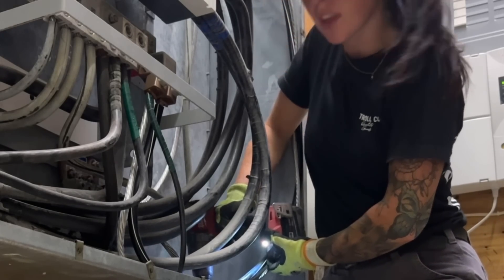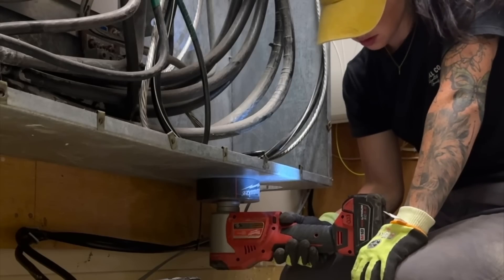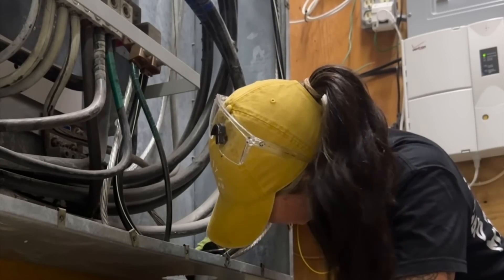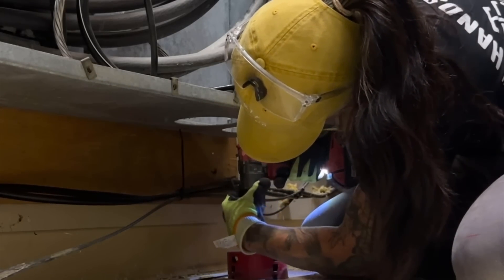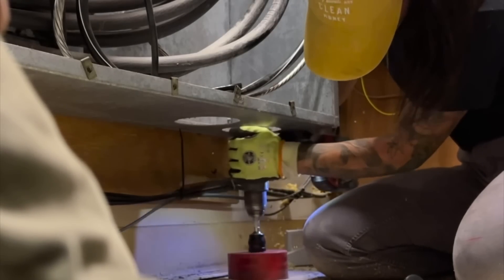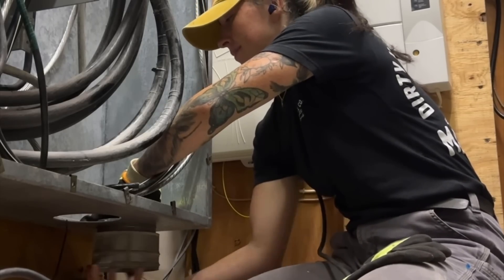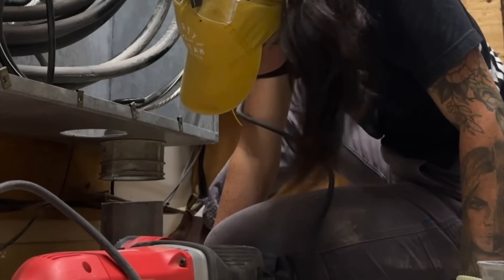We're coming in from here into that other space where I was drilling holes. The plan is to feed parallel coppers from the disconnect we're installing into a transformer, and that transformer will feed into a second disconnect, which will power a lot of the medical equipment. We already have a transformer outside, but we need another one specifically for an MRI machine — it's an MRI-integrated system. We still have to run wire for the chillers and run wiring inside the MRI room itself, all through a raceway. The deadline is next week, so there's going to be a lot of content coming.